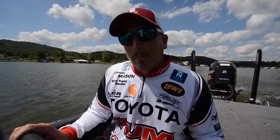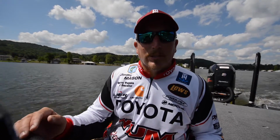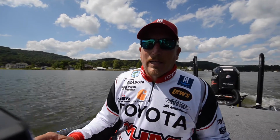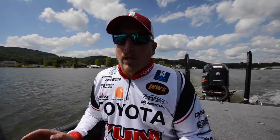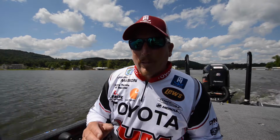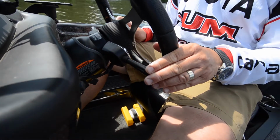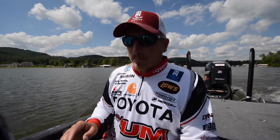In addition, when I get back in there, I can also use that hydraulic jack plate to get on plane faster when I'm coming out, and this saves me a lot of idling time getting back to deeper water. The way I do that is I'll raise the engine all the way up, and I'll plane off. And as soon as my boat starts to break over, before the prop can lose bite, I'll start trimming down. This allows me to jump on plane much faster and save a lot of time idling in and out.